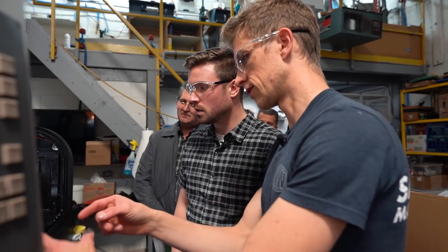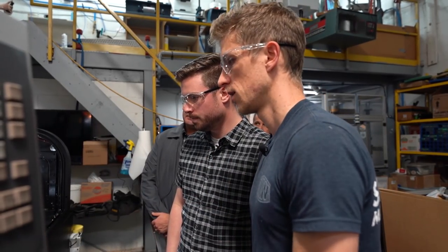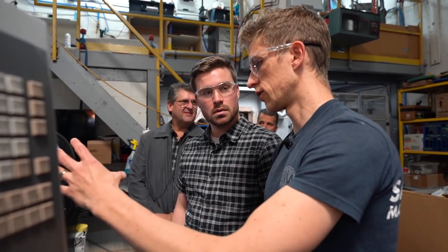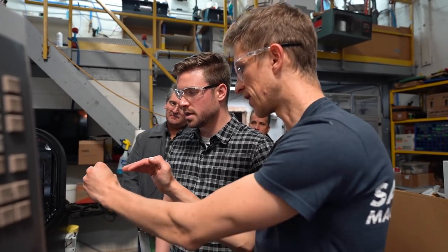But yeah, what that does, the main spindle clamps, it's gripping the bar, and now it's shoving it forward and backwards through the guide bushing. And then it automatically retracts backwards based on the length of your part. So for your part, if it's 2 inches long, it'll open, it'll go back 2 inches, and then it's ready to make the next part.